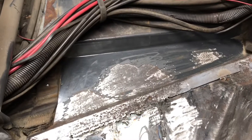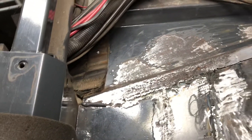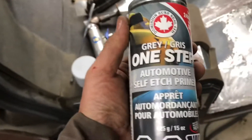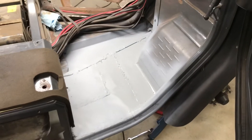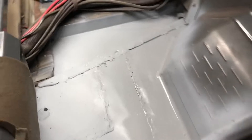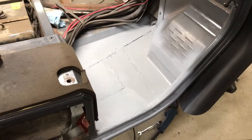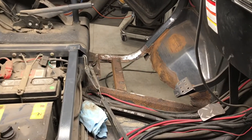I've cleaned up the pan center section, moved the wires and everything out of there, and used a grinding wheel to rough it up and get rid of as much rust as I could. Wiped it all down with acetone and just going to spray it with some self-etch primer. The etch primer looks pretty decent, and now let's go make progress on the other side.